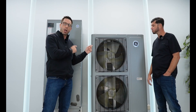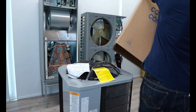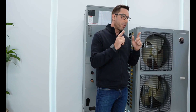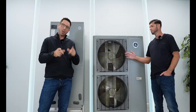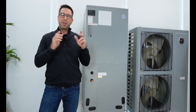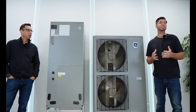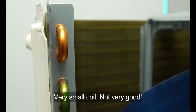First of all, this is a side discharge unit. For those who don't know what side discharge condensers are, we brought in a top discharge unit to show you the difference. Top discharge units expel the air from the top, while side discharge units expel the air from the side, like this one. Typically, condensers under 3-ton have one fan, but 4-ton and above have two fans on the side. Side discharge units are very popular in Asia where spaces are smaller — this design takes up less space, however they have smaller coils. Usually, side discharge units lose more BTUs in heating and cooling mode when temperatures outside get really high or really low, due to the outdoor coil size being smaller.